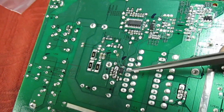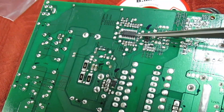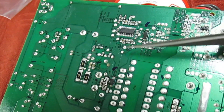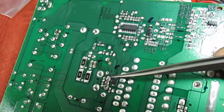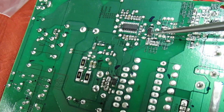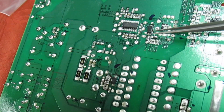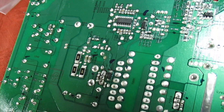That's the back of the board — that's the MOSFET. It looks pretty simple there. There's a chip that's obviously driving the MOSFET. What we're going to have to do first is check the gate drive resistors that go from here to this chip, and there are probably one or two other things to check as well. We're going to have a quick look at the service manual first and make a list of all the parts we're going to be changing.